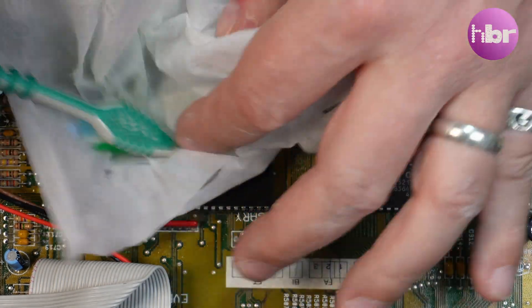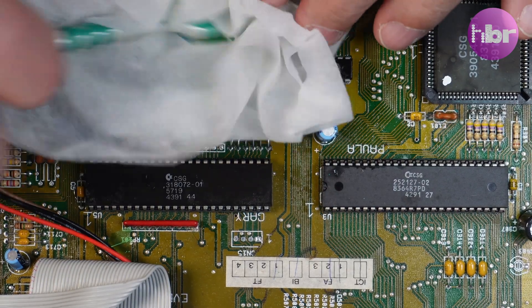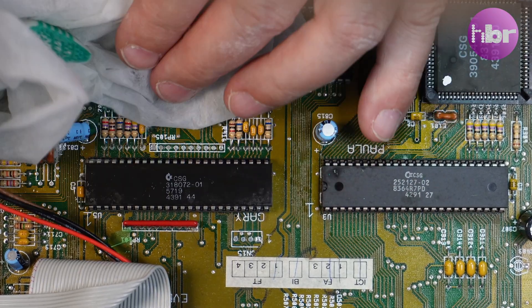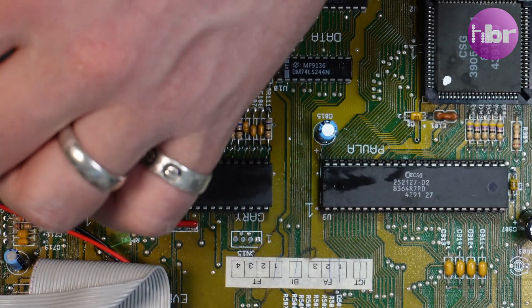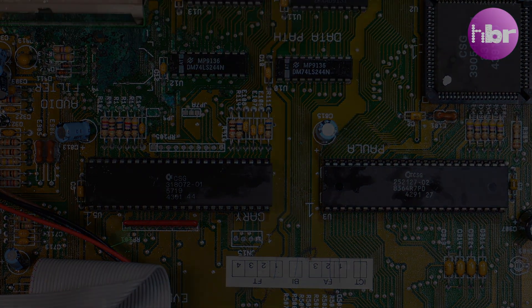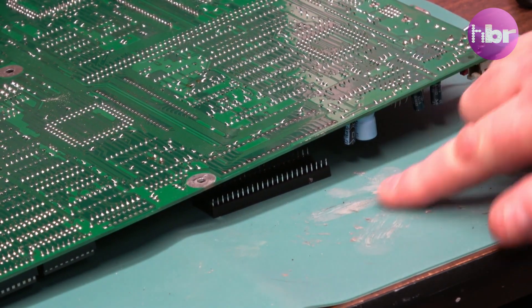But that's not the full story, and this is where things get slightly worse. Most of the solder joints in vintage computers use tin-lead solder. When potassium hydroxide reacts with the tin in the solder, it forms tin hydroxide. Over time, tin hydroxide can break down further into tin oxide, which is non-conductive. So instead of a strong solder joint connecting components, you end up with a crumbly, brittle mess — leading to strange issues, intermittent faults, glitches, or complete failure of a machine. Tin hydroxide and tin oxide are white, powdery substances, and depending on the composition of the solder used, it's entirely possible to degrade solder completely to a powder. I believe this is the phenomenon observed by Chris Edwards: 'I'm desoldering the socket and all this cocaine dust fell out — I don't know what it is. It fell out of the socket when I took it out.' Suggesting that the solder originally used in these machines was particularly high in tin.